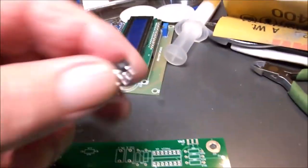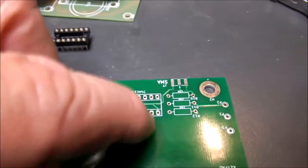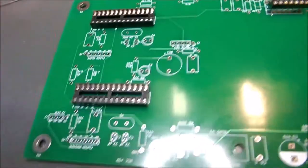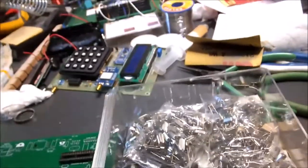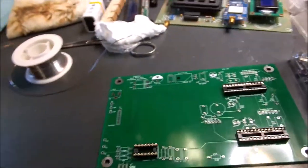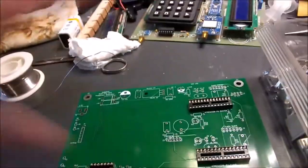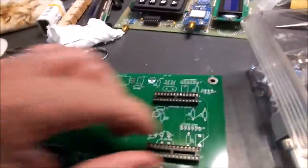Our next order of business is to mount this 14-pin IC socket right here on the circuit board. That's where we're going to mount our trigger IC, and then we have all of our IC sockets on board already. Well, it's kind of up for grabs from here which parts we install. I like to put in the lowest to the board parts first. It's easier to turn it over and solder them in without doing a lot of clamping. And we put the sockets in already.